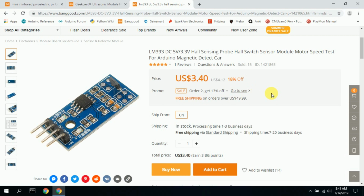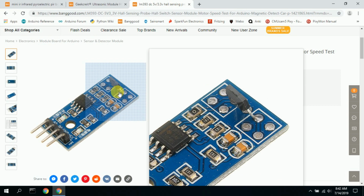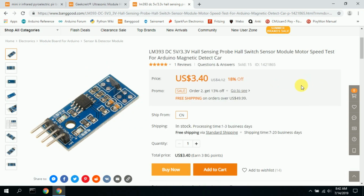I think it was digital pin 10. And I just monitor digital pin 10 for changing its state from high to low. And so anytime one of these goes low, it pulls that pin low and it's trapped. And so that worked the best for me.